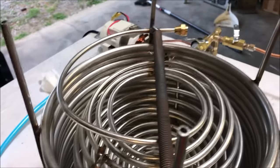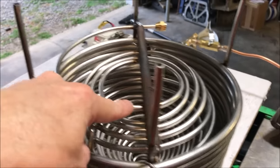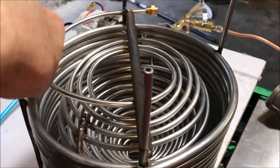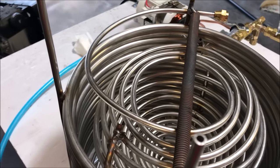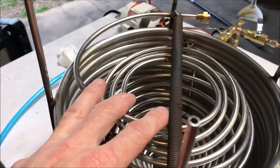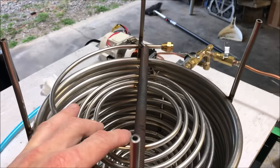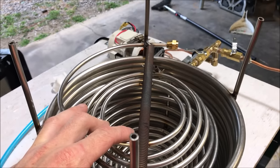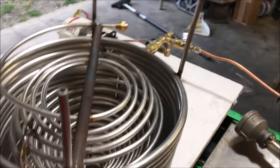If we go with counterflow, this will be the discharge line. So we'll have an entrained flow traveling through this portion of the coil, boiling away, possibly being converted into superheated steam. Monotube boilers are different than tank boilers. The steam charts and all that stuff don't apply. You can superheat steam in a monotube boiler without being at the pressures needed that would be displayed on steam charts and all that stuff.